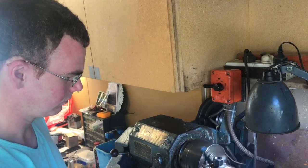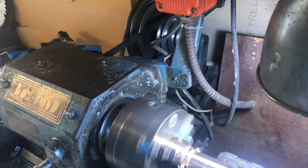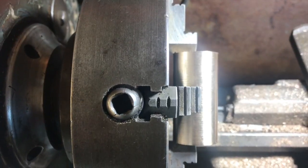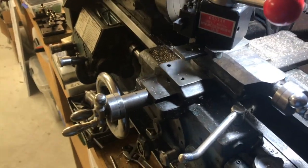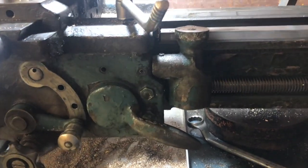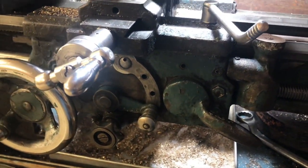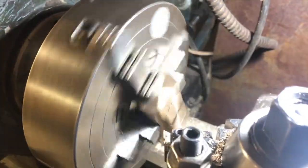For the next stage I need a piece of bar cut off. My wife's nephew Robert from Australia is doing this little job for me. We'll put this in the four-jaw chuck sideways so we can cut a flat surface across the front — basically using the facing technique you'd use on the end of a bar, but across the side. We're using the automatic cross feed; the selector lever is now in the bottom position for the cross slide, and the half-nuts lever is pulled down so it's not engaging the lead screw thread at all.